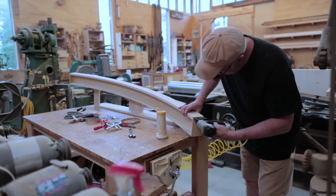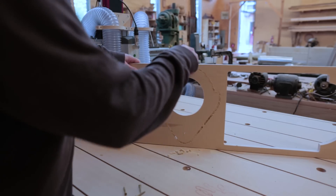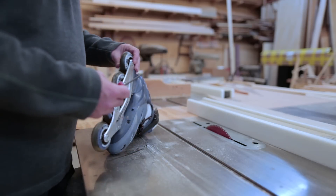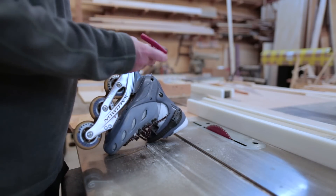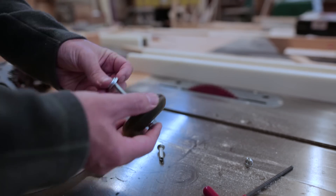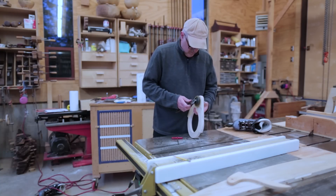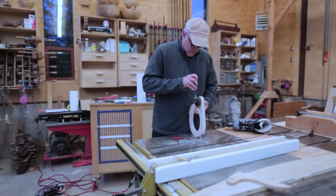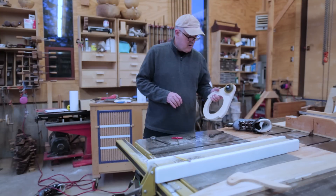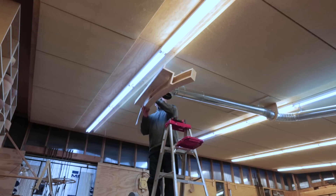Now I can make the little piece that holds the wheel and the pipe — this is what will move back and forth within the beam. For the wheel I had bought a pair of rollerblades at a thrift store to use the wheels for things in the shop. I pulled a wheel off and a 5/16-inch bolt fits in there perfectly, so I could bolt it to the wooden piece. Because of how the bearings work, you can clamp it with the bolt really tight and the wheel still turns. You can see how it's going to fit within the beam.